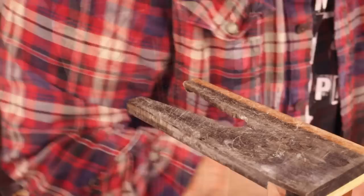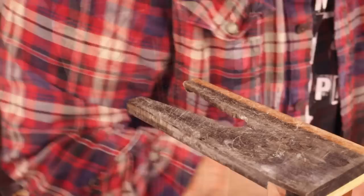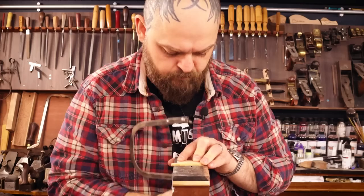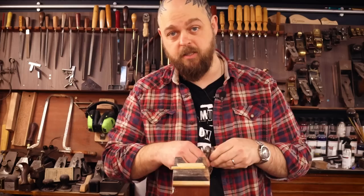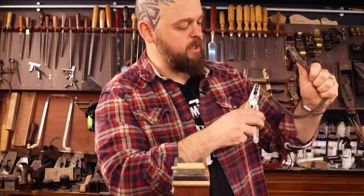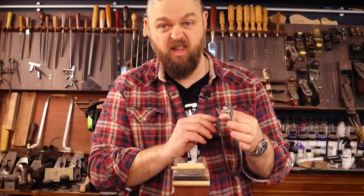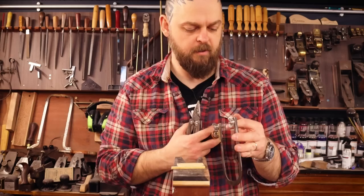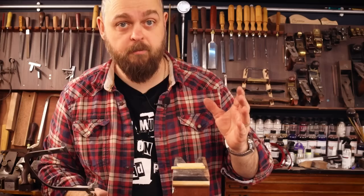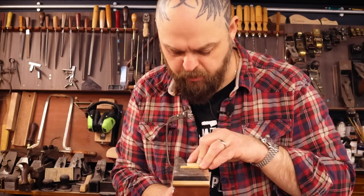There we go — that's the front of that then. I could probably do with a slightly coarser blade. I constantly break blades — it's just the way it goes. If you twist in any way, it just happens. As you use them they go blunt fairly quickly anyway, so it's a blessing in disguise. Now I'm using a skip tooth blade — it is designed for an electronic saw but it does the job.